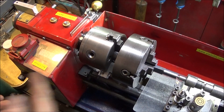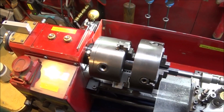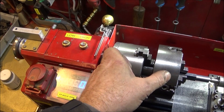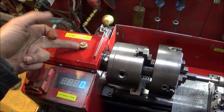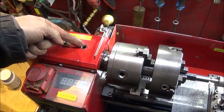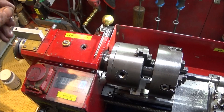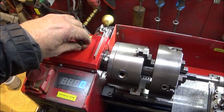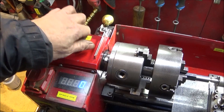You can see this is a really great setup and one which will save you no end of time. Just before I go, I'd like to show something of interest — you can see down here on the spindle at the front of the headstock there's a nice show of oil coming out the front. When I did this upgrade for the oil port to oil the gears inside, I can actually use my oil can to fire a nice thick solution of oil and molybdenum disulfide right down into the bearing, so I know those bearings are nicely lubricated. It's well worth doing this upgrade.